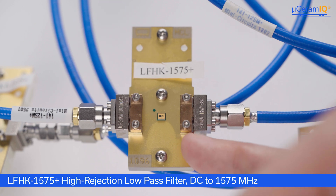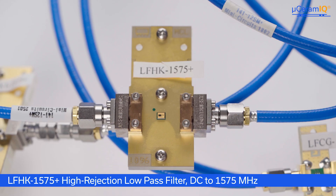Additionally, a stripline PCB design is required for this device to reach its fullest potential. Mechanically speaking, our LTCC high rejection filters are not compatible with coplanar waveguide or microstrip traces. These top-level RF traces will cause the ground and RF pad to short on these high rejection filters.